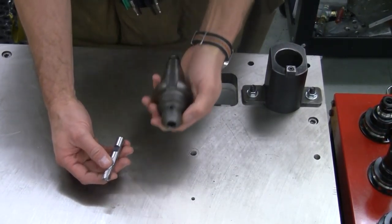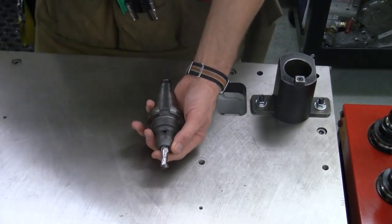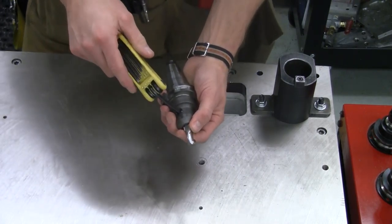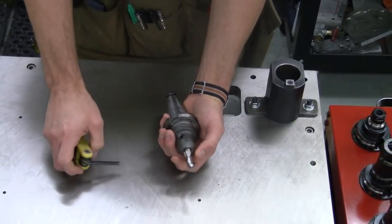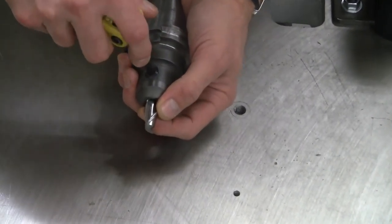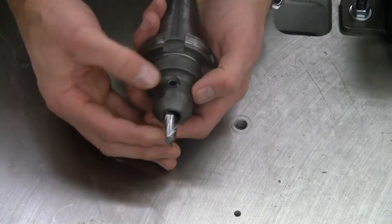When loading a tool into your end mill holder, you want to slide the shank down inside, align the flat spot with the set screw, and then tighten it down. For inexperienced people, that can be tricky because it is possible to get it slightly twisted. If you slide the tool in and tighten the set screw down without the flat spot aligned, you'll be tightening down on the shank of the tool, and there's essentially no holding power as you start machining.